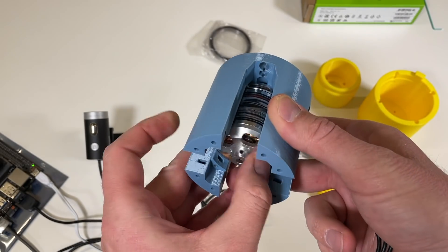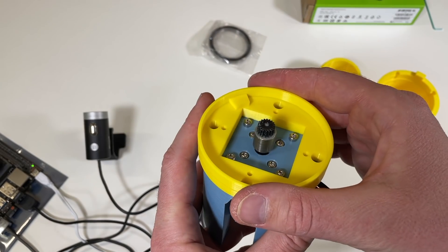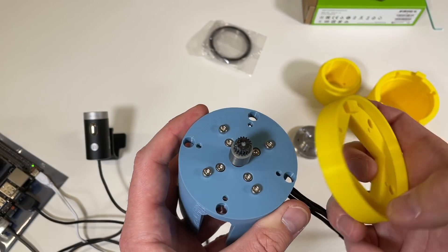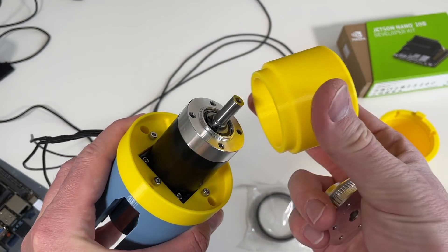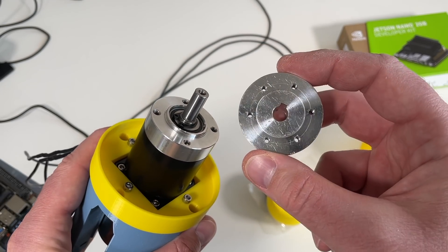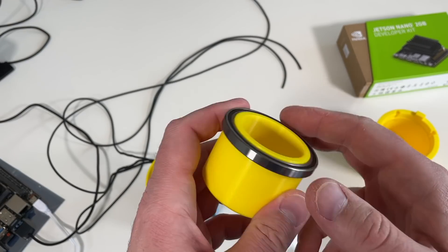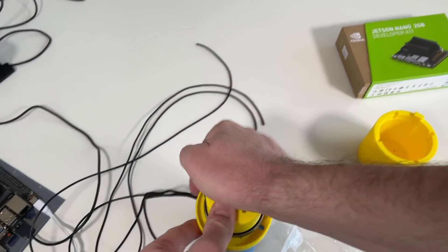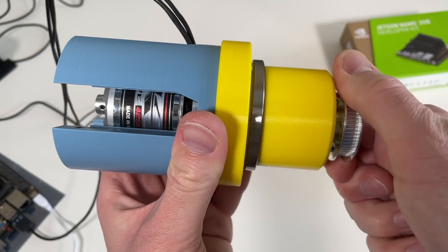On the blue part I have installed the motor and the gear for the planetary reduction. On the other side I will install the encoder with the magnet. Now I will install the limiter, which limits the rotation motion, and the gearbox goes here. I already put the screws for the gearbox so the nuts won't fall. The limiter is installed, the gearbox is installed. The next piece will hold the bearing, and afterwards I'll install the pulley — which is really a shaft coupler — and our load will be fixed with six holes. The output shaft coupler is fixed.